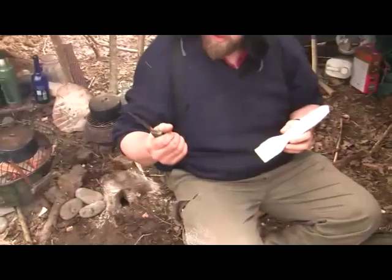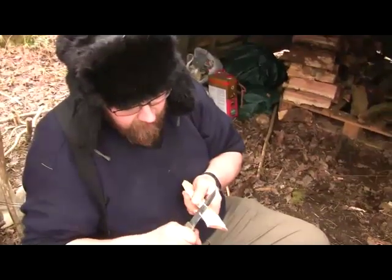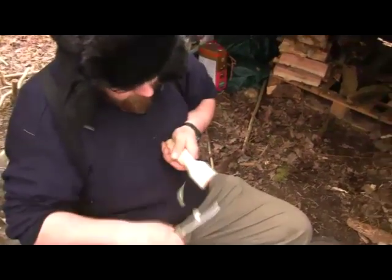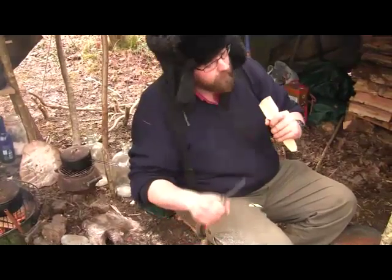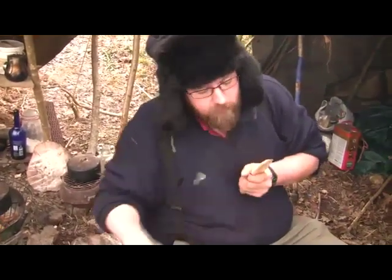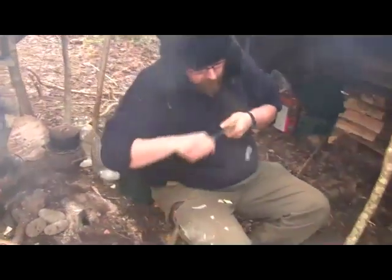We've got a high carbon steel knife here and I'm just going to start whittling away. I should have got rid of the bark first, because like I said it can be deceptive — it's often quite thick and once you've removed it it may change the shape quite a lot. I'm just continuing to shape the bottom of the bowl, holding it in my left hand, making sure no one's in my way. I've got a good firm grip and I'm just trying to get nice long shavings, removing material with each cut. Taking off quite a lot of material from the corners, trying to keep a smooth curve.